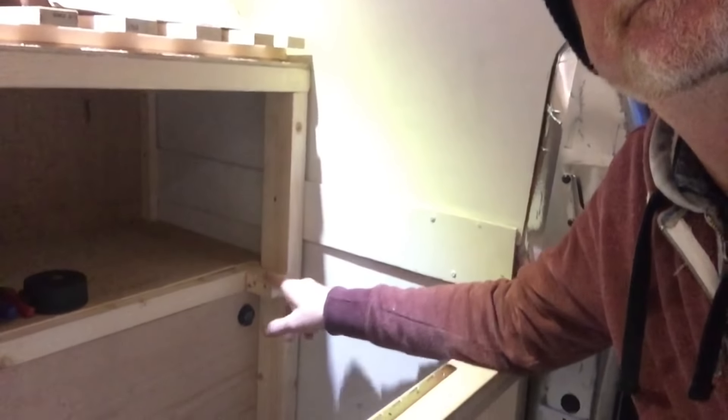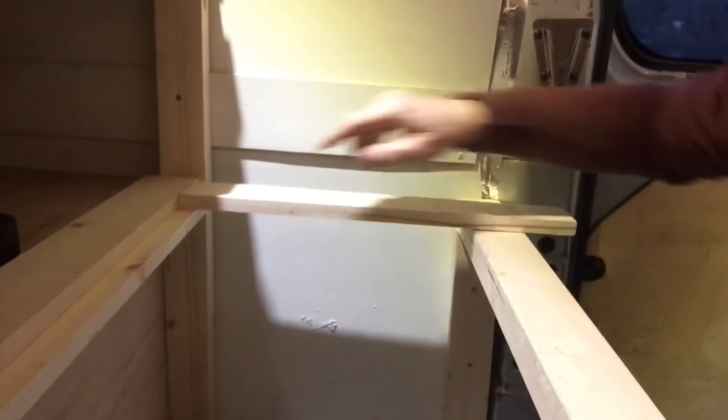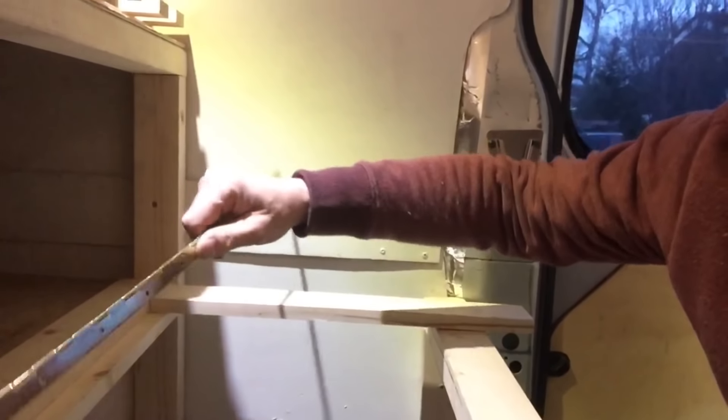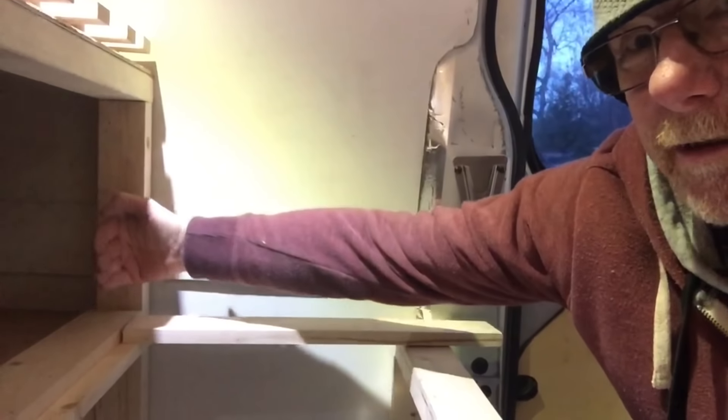I figured out what I'm going to do. I've put some stops here, level with this edge, so this piece — I've just screwed it on roughly as a step — you see the step? That's just two pieces screwed together, going on there like that. Then a piano hinge along here — this piano hinge goes in there and lifts up like that, bringing it level with this. The door will sit just on the inside edge of that, maybe out just a fraction to make sure it clears. That's how I'm going to do the bench and the hinges.